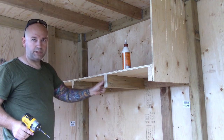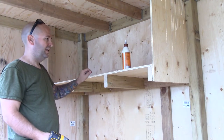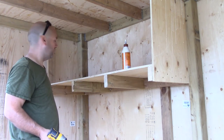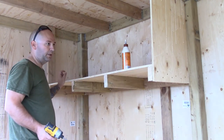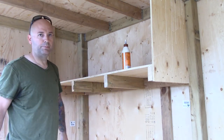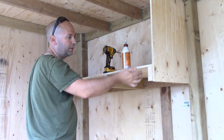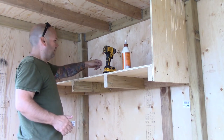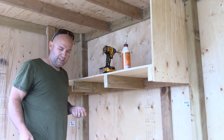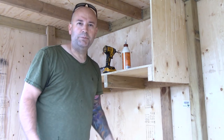All right, and you notice these ribs here. These aren't necessarily much in the way of structure as it could be if I put a little front brace right across four of them and onto the sides holding things up. So that's what I will be doing. I'll get one final piece of 2x4 and make a front lip, and that will close all that in. Okay, and I'll bring the front lip up. I may even bring it up even with the plywood. It's not a big deal. All right, so, shelf is done, outside paint is done, and I'm done for the day.